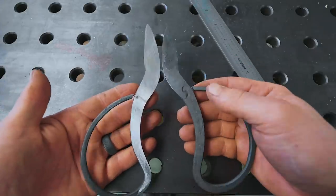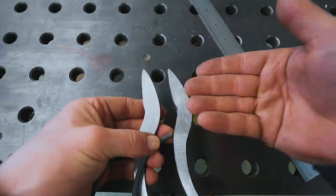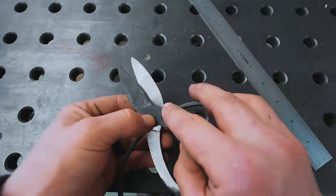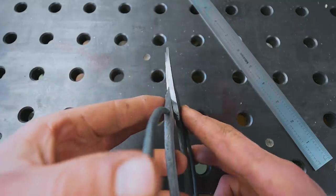When you have a look at this exaggerated view of how a pair of scissors cuts, you'll see that the curved scissor blades, as they cut, are creating a tension from the spring of the blades that pushes the two edges together to actually shear the paper. It's that sideways tension that is the key to a good pair of scissors. So this is the challenge: how do I make sure these have the appropriate amount of sideways tension?